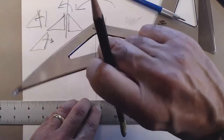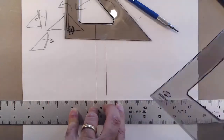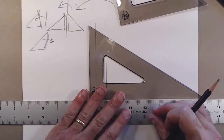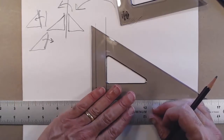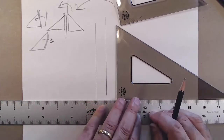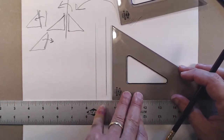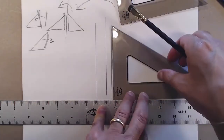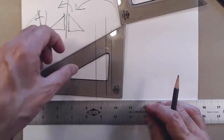When working with triangles, whether you have a T-square or just two triangles, you hold one tool — in this case the T-square — firmly, and as you move the triangle you keep a couple of fingers open so you can lock it when you draw your line so it doesn't move. Testing the second triangle — it's also true square, which is great.